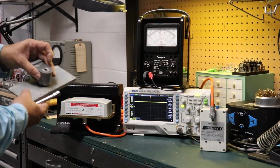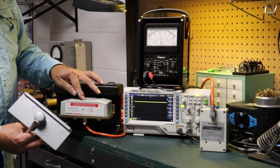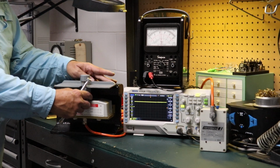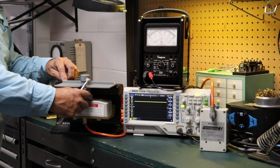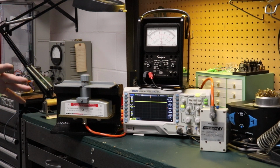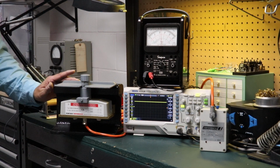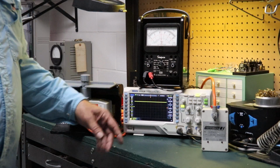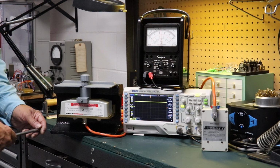I take this and you'll note there's a groove in it here. I'm going to slide it over this little ridge at the center of the sensor. I'm going to push this until the test plate, the SSPV1 test plate, just kind of aligns with the gauge side of the head of the rail. So you don't want it to be touching the head of the rail, but you do want it kind of lined up if you look vertically downward with the edge. So this guy is now sitting on top, and of course my R58's turned on. And my voltage has changed ever so slightly, maybe gone up half a volt or so.